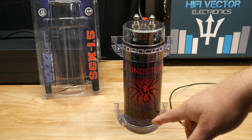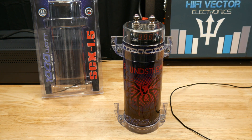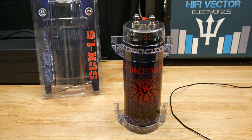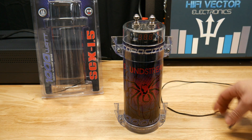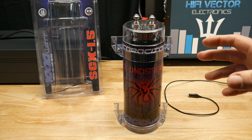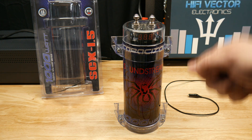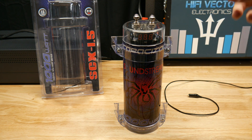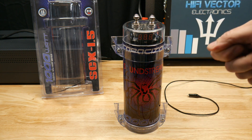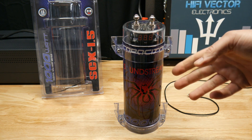They're made with metal plates inside and an insulator. The reason why they include a little resistor is if you just apply the positive and negative, there's no buffer inside to allow the voltage to just freely flow in. It'll act like a dead short — like if you took a power wire and hit it to a ground, it would spark, and that can damage not only your terminals or your cables but it could damage the cap.